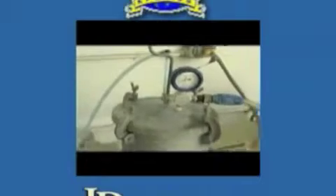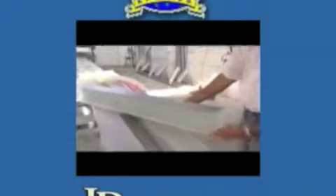We turn on a vacuum and draw a vacuum — all the air escapes out and we're drawing in the resin. Little by little, every piece of glass, every piece of carbon fiber gets wetted out perfectly. One of the advantages of a resin-infused part is you have the same weight part, the same strength part with no air voids — and that means strength — and you get that every time. Not only boat builders are using this technique, but people are doing this more and more at home. JB, we need to thank you so much for all that you're doing for the marine industry. This was great.